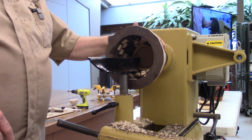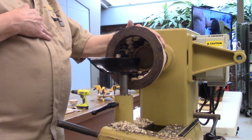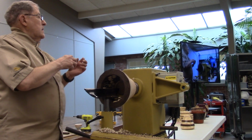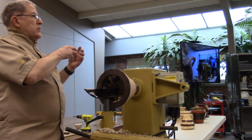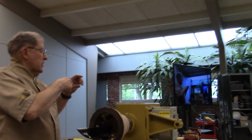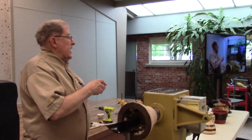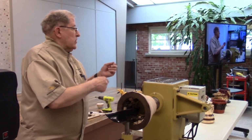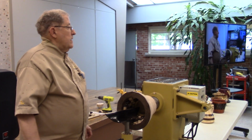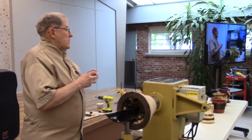When you sand it, do you use a flap sander or a drum sander, a round thing? Well, I just got a thing you might have seen advertised, an inflatable one. It's got an end on it that you can buy the sandpaper sized and taped together. You put that on the end and then take some compressed air, and it expands it. Put that in your drill, and it makes a great sander for the end or the sides or whatever inside. It's soft and conforms and takes off the high spots. Right, it's an inflatable sander.